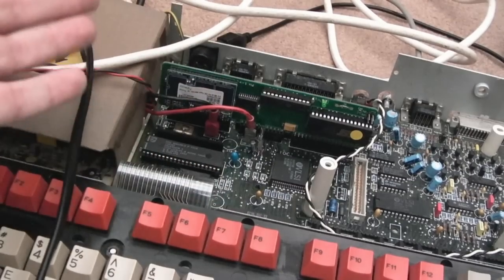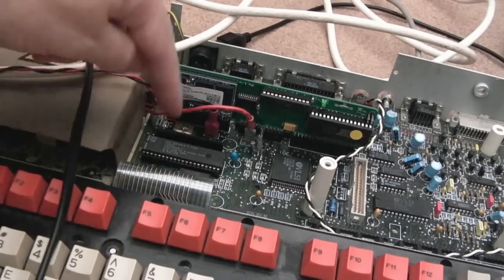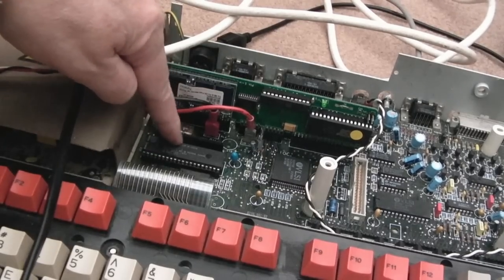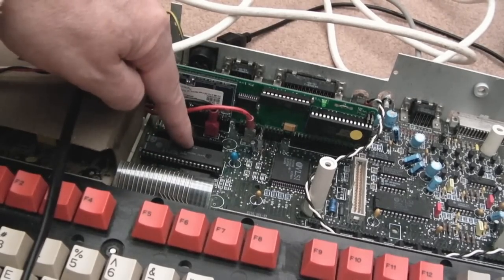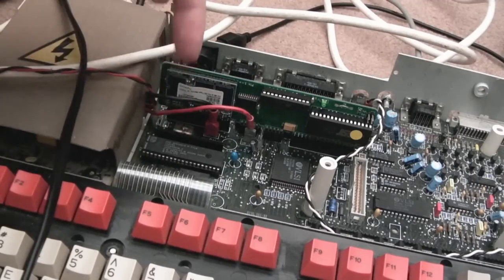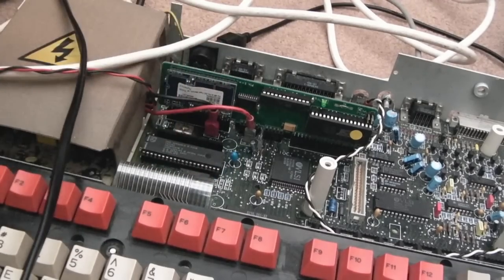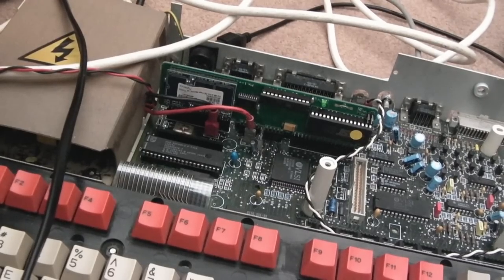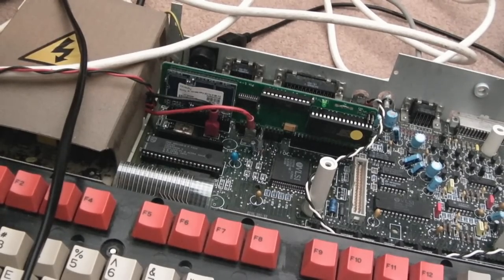And at that point, still couldn't get any further. The keyboard wasn't working. That was when I started measuring connectivity and found that I think two of the connections up here on the keyboard MCU were not going to the top connector there. That was all that was wrong. So yeah, I'm amazed. Wait until you see the underneath of it. It is scary as anything.